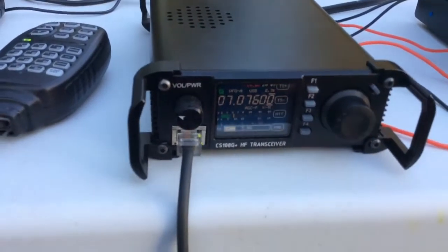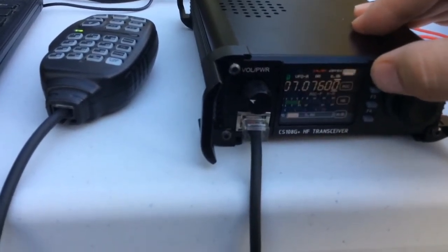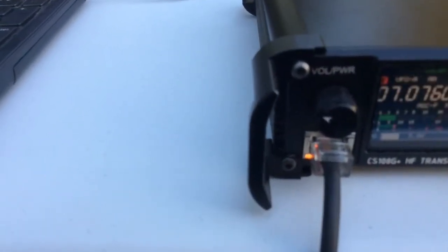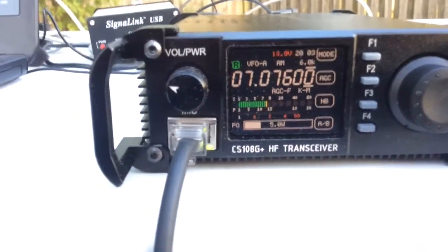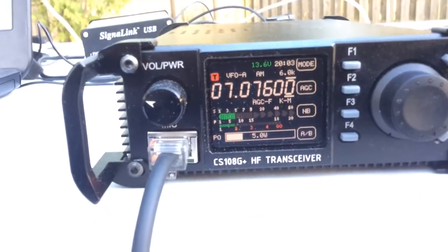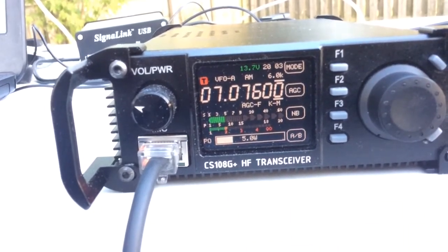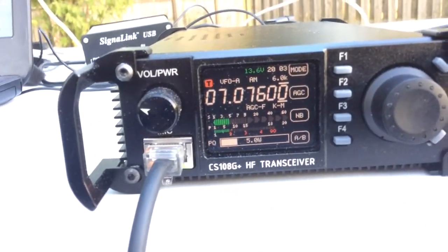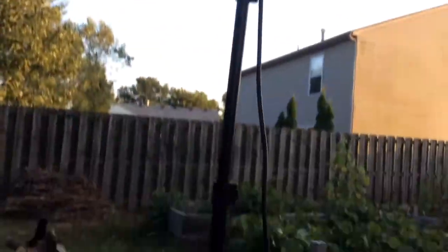There's about the peak. Now I'm going to switch to AM. I'll go ahead and key up and look for the SWR — it looks like we're at 2 to 1. SWR 2 to 1 isn't really all that bad, but I think we can do better. We're going to try. It looks like 2 to 1 is about the best we're going to get, which means we could probably adjust the antenna a little bit. I have the antenna coming down, so I'm going to raise it.